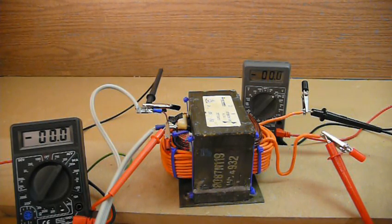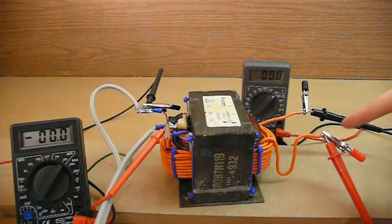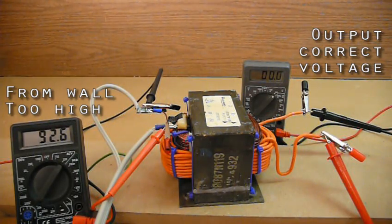The parts of a transformer that work this magic you've already seen. You need two or more coils which create and absorb magnetic fields, and then you need a core that helps contain and direct the magnetic fields from one coil to the other. And that's it — that's a transformer. When you input AC voltage to only one coil, called the primary coil, even though the other coil, called the secondary, isn't connected by any wires, you get an AC voltage out of it. The only connections between the coils are the invisible magnetic fields.